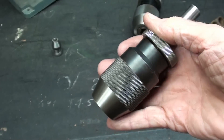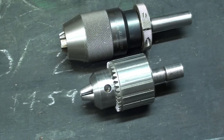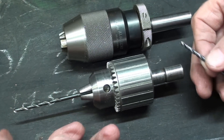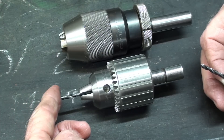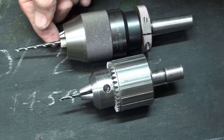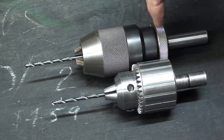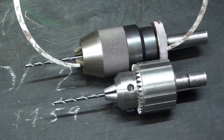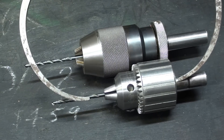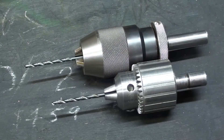They are an amazing drill chuck — I'm mesmerized by the perfection of these tools. There are several things I do not like, however. For example, with eighth-inch drills, if I put one in, watch how far it goes into the chuck — way onto the flutes. That isn't true at all with the Albrecht. Furthermore, the chucks themselves are much longer. Compare it to a little Jacobs chuck of the same capacity — this one is about an inch longer, which can be problematic on a milling machine where you don't want to keep raising and lowering the table.